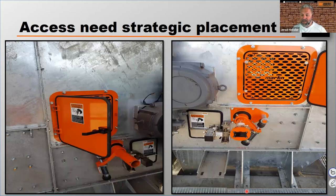Components should be strategically placed with safety considerations in mind for those inspection doors. If you're operating or maintaining a conveyor, there should be protocol that a worker will not break the plane — it's fine to reach into those inspection doors to access equipment, but only when you're locked out and tagged out. Best-in-class safety facilities usually have policies stating you do not break the plane of a conveyor without it being locked out and tagged out.